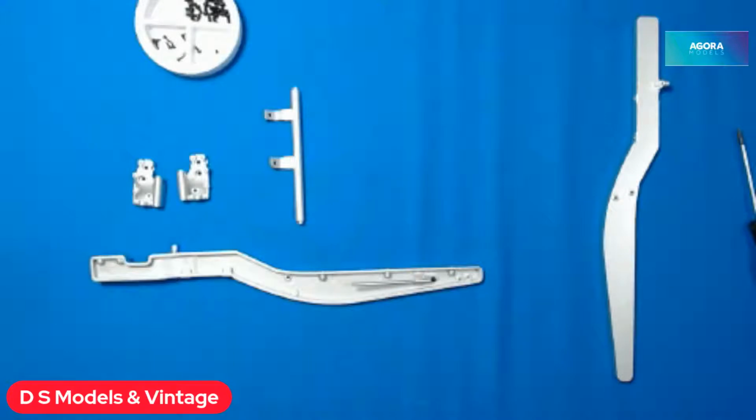All right, let's get on then. So what's in stage 2 then? Step 2, sorry: fit the right mount 27F to the right beam 27B and fix in place with 2 FM screws. Repeat, and repeat, and repeat, and fit the left mount 27E to the left beam.